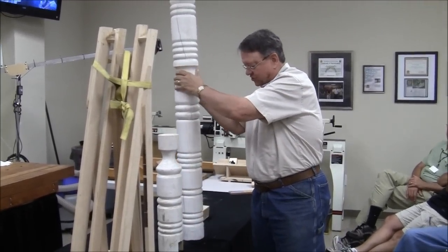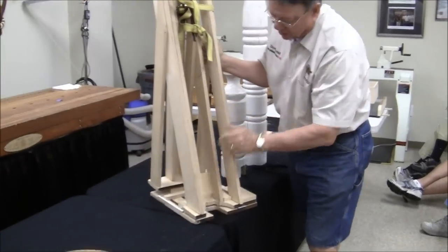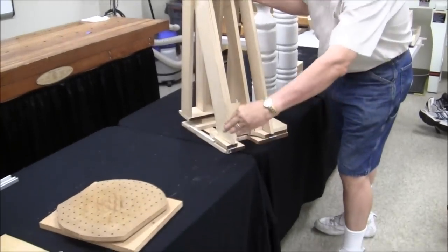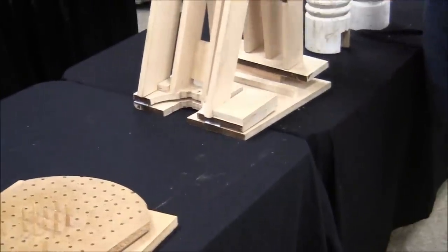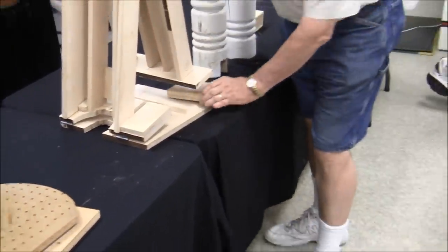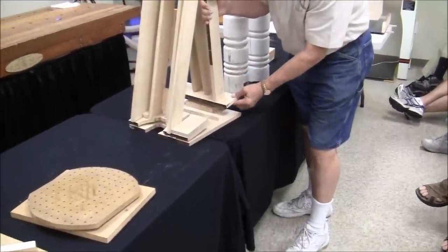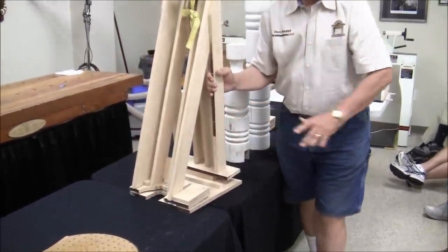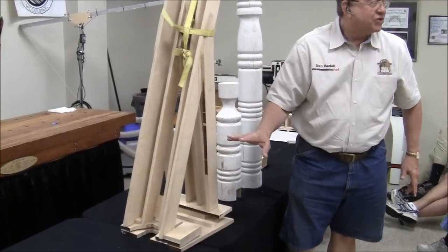And by using the fence of the table saw, I could control it going this way. And I put a little mark, you know, not to cut past a certain thing. And then this, I mark these by degrees. And so I'd have 3 or 4 of them. This might be 18 and 17 and, you know, down. So this way I could control whatever depth I was cutting.